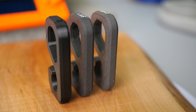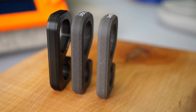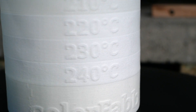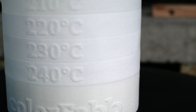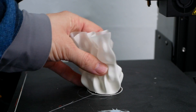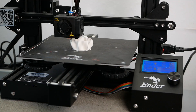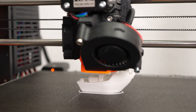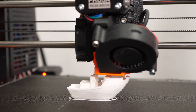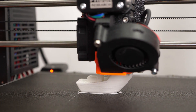With lightweight PLA, this is used to make the material itself lighter while still preserving some material properties. VarioShore TPU specifically uses the degradation of mechanical properties when you lower the density. This results in very soft parts on printers that would otherwise not be able to handle flexible filaments, or even printing flexibles faster because you generate more material volume in the nozzle and therefore the extruder doesn't need to work that hard.